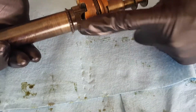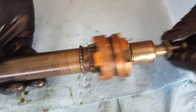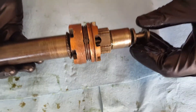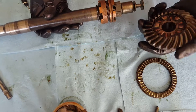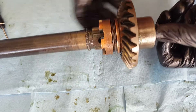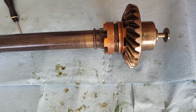Now your pin that holds the dog clutch in will not come out, the shaft is in place. Double-check: prop end faces this way, reverse gear is this way, and forward gear is the other way. The forward gear is the gear you cannot remove with the propeller off. The reverse gear goes toward the prop nut and the forward gear goes the other way. That's how your forward gear gets engaged — that's neutral, and then reverse just like that.